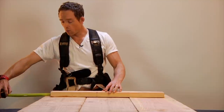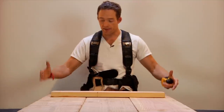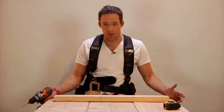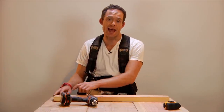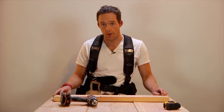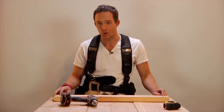Here's our first 2x4. I'm going to have about a 7-inch setback from the edge of the table, so I measure in 7 inches on either side to make sure that the 2x4 is relatively square on the underside. That gives us a 7-inch setback, and on either side we're looking for about 2¼ inches. I'm putting in pilot holes for the ends of this 2x4, because if you drill into wood close to the ends without a pilot hole, it's likely to split unless you're using special self-tapping screws.